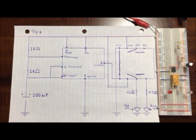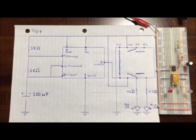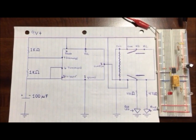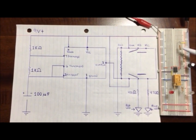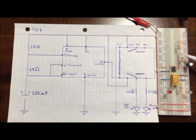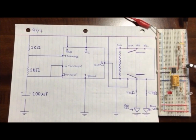Today we are going to build a 555 circuit. The 555 timer is a general purpose timer chip. It is used in a bunch of applications when a delay or repeating cycle is needed. To start out, we have a 1K resistor and a 10K resistor, ran in series with the 100 microfarad capacitor.